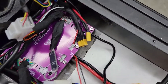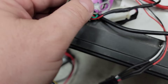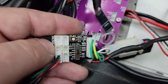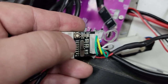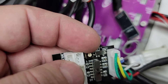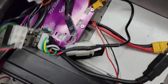What's different is I got this little throttle adapter from them, which allows easy hookup of throttle and brakes. It allows you to select 3.3 or 5 volts to be applied to the throttle. It also has a switch where you can hook up a proportional brake or just a normal switch brake. I hooked up a normal switch brake because I don't have a proportional hall sensor brake.